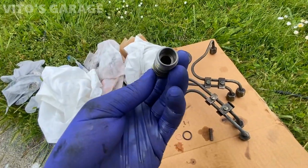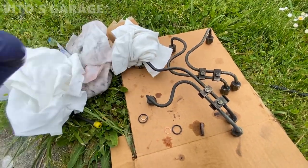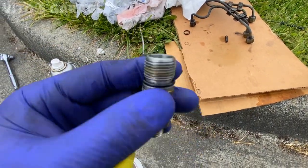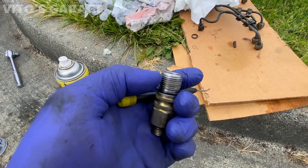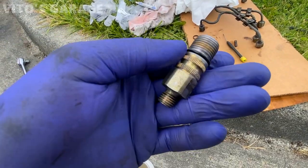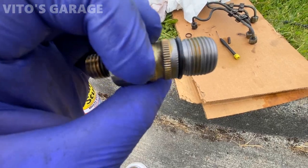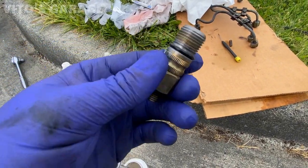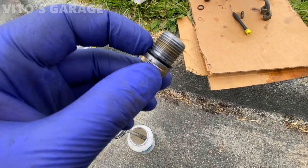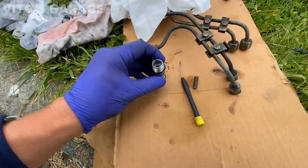Here's the delivery valve all cleaned up. Make sure the surface where the crush washer goes is clean. When you put the O-ring on, use a tiny screwdriver because you don't want to roll the O-ring through all the threads — rolling it will tangle it up. You'll know when the O-ring is not sitting properly because once you turn it, it'll be all over the place. This one's sitting pretty good. I'm using just a tiny bit of silicone paste — if you have diesel that's even better.